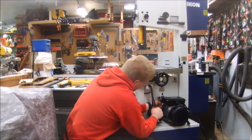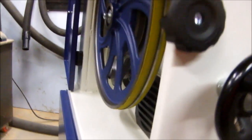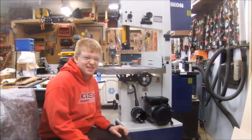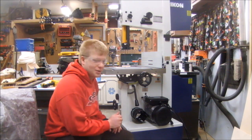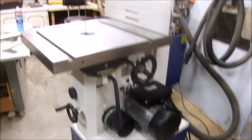After the first adjustment I actually went a little too far — the top one is in the center of the wheel but the bottom one is behind center now, so I went too far and had to go back. After the second adjustment I again have the blade centered on the top wheel, and on the bottom wheel I'm just a hair behind center, so I'm going to go about an eighth of a turn. I want perfection. I had a brain fart and went the wrong way, so I had to go back again. Finally, I have the blade centered at the top and centered on the bottom wheel. It took about eight or nine iterations, but I finally got it.